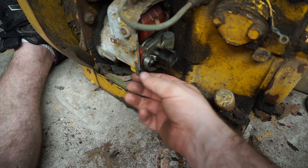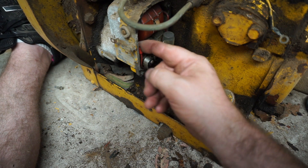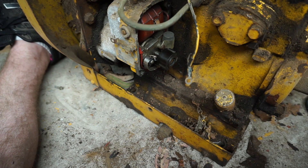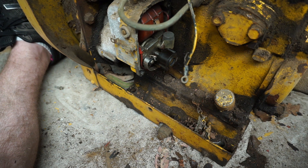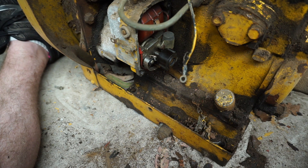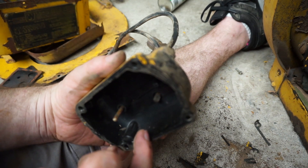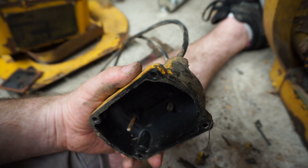I think I'm going to have to find a new magneto gasket as well - I think I'm just going to buy lots of gaskets. Where the coil actually earths onto the chassis of the magneto is looking a little bit grotty. So I might actually just take that off and clean up that connection. For the moment I'm just going to see if the condenser works. If it doesn't work at all, my next step will be to replace the condenser, because that's most likely what would be wrong with it. I don't know how well you can see that but it does appear to be a little bit pitted, but it's mainly just dirty. Let me zoom in.